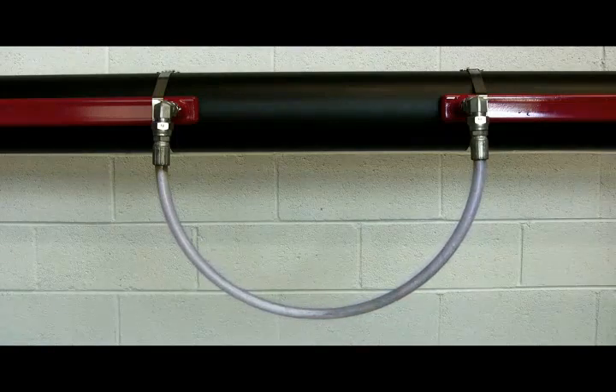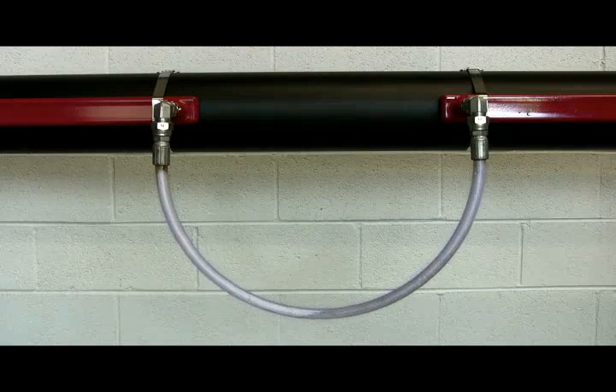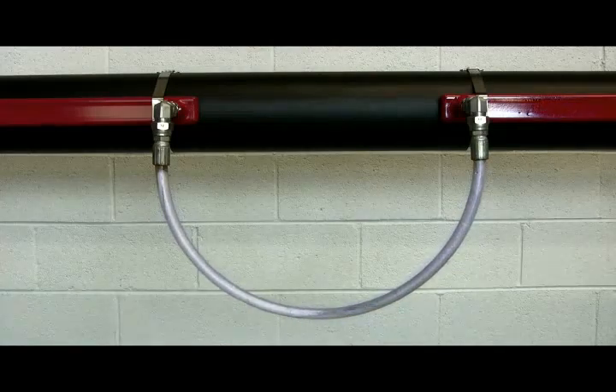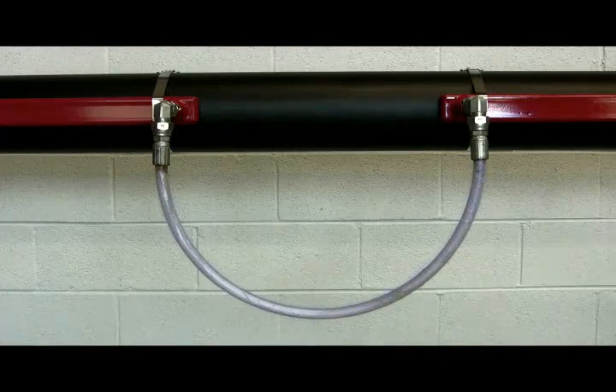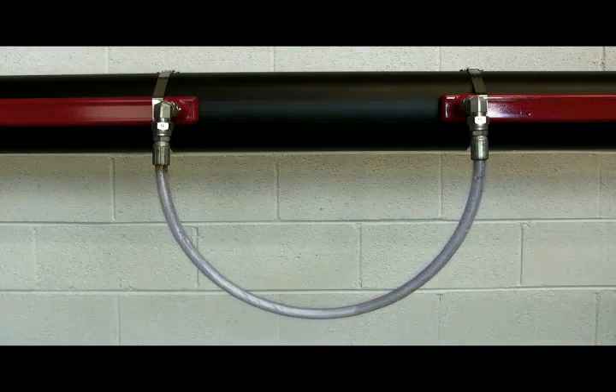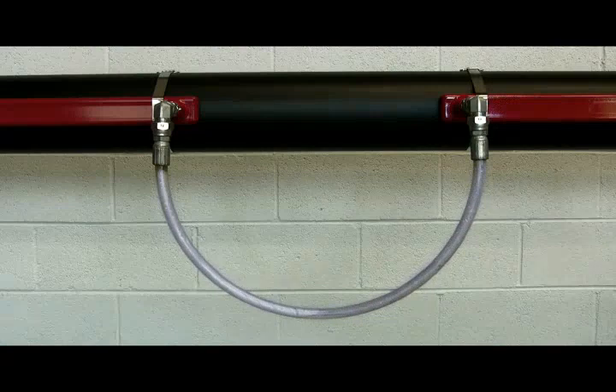A foot of water column represents a little less than half a PSI in flow restriction. So the 45-pound steam has more than enough energy to overcome the water column and flow into the next ContraTrace element. But the steam does lose some pressure in the process, and this pressure drop must be carefully considered in laying out the circuits in a steam jacketing system.